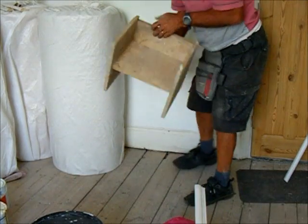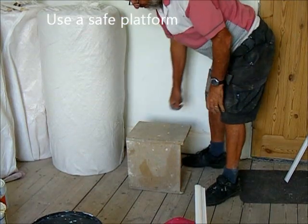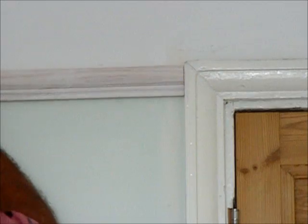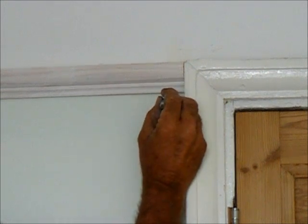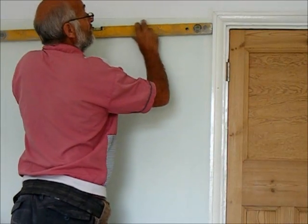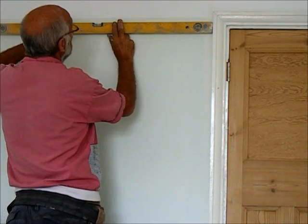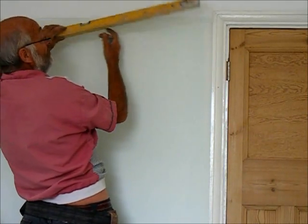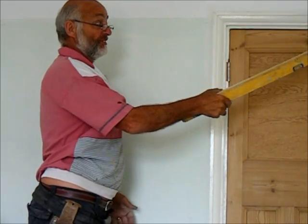A useful tool is this little stool hook I knocked up - it's wider than it is high, so I can use it that way up if I want a little bit of height to look down on top of the rail. That one is broken up underneath. You put the picture rail flush with the top of the architrave, then mark it, and then we're going to level them round. We've got a mark and then we level off all the way round, making sure they're level single marks.